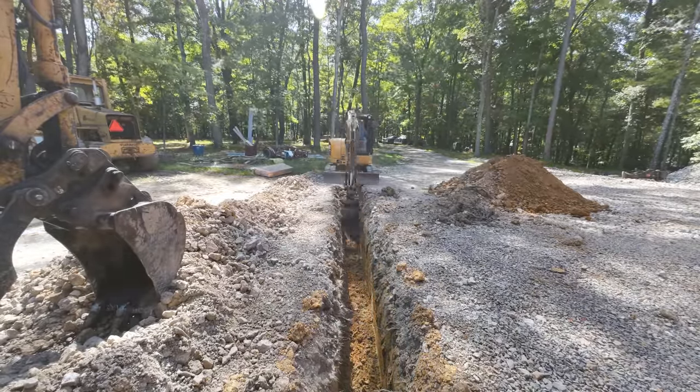This section right through this area, specifically the area from where our transformer pad is going back across the driveway here to the last pull box, that section went back together pretty darn well. This was a very fine powder, pretty sandy, and it just pretty much fell right back into the hole. Now it is still a humped up area, as is the entire ditch line. I left that material humped up because it came out of there. It pretty much has to go back in there.